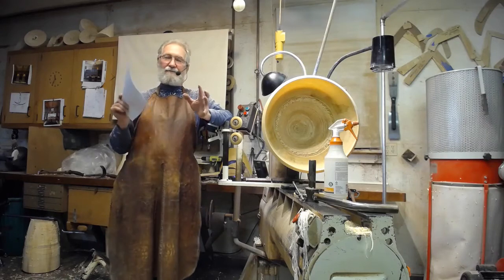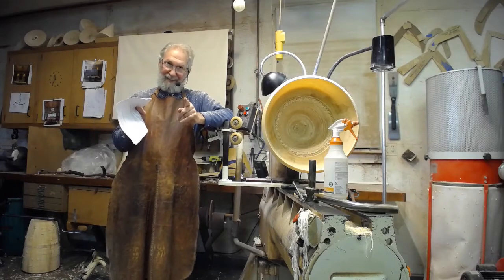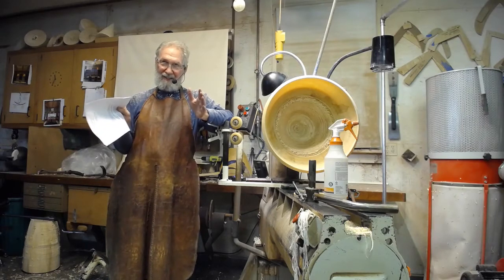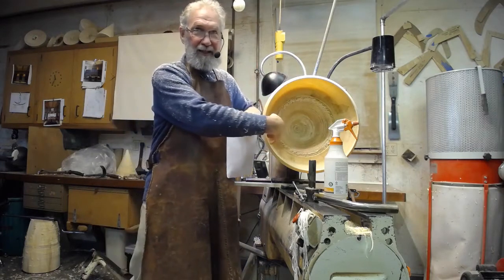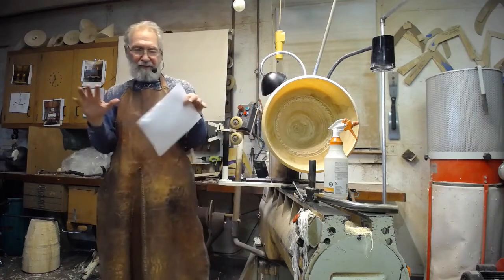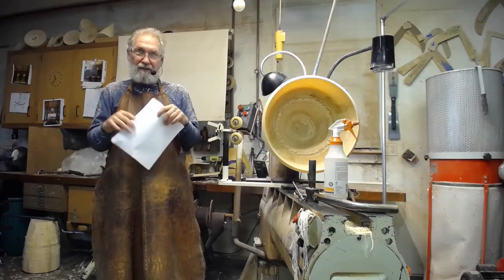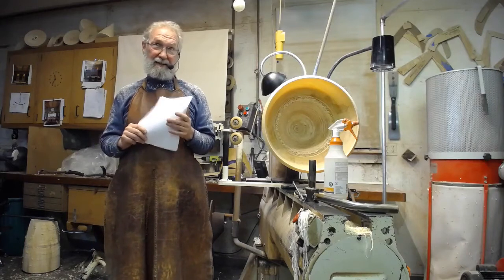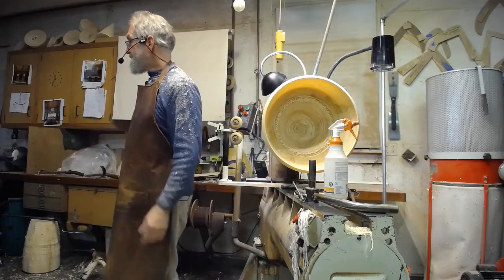Well, that's a funny detail. If you do decide to try this out, don't make something really small. It's actually harder to make a 10-inch diameter shade than a 13-inch diameter shade. When you get really small, it's much harder to do the work on the inside. It's much harder to see that inner surface to make sure the translucency is even, and it's just so constrained in those small spaces. It's much easier to have a little more room to work with, as long as your lathe is up to the task. Having a one-way definitely helps. Go to Dick's house. Make it on Dick's lathe.